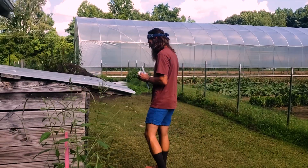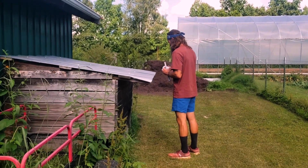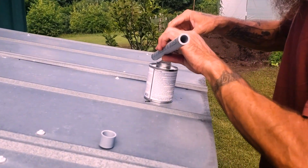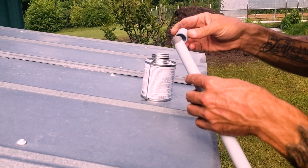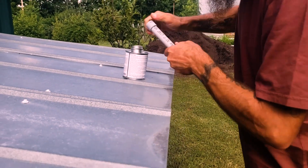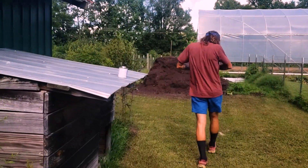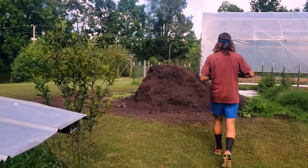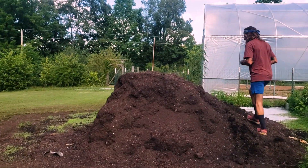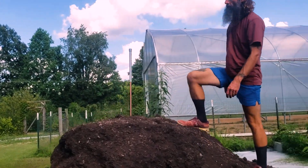You want to use a diameter of PVC that is slightly larger than the ground rod so it will slip over. I'm putting a cap on the PVC to make a bigger sleeve — basically a larger cap that will slip over the 5/8 inch ground rod. It should slip right over and be a tight fit without being hard to get on.